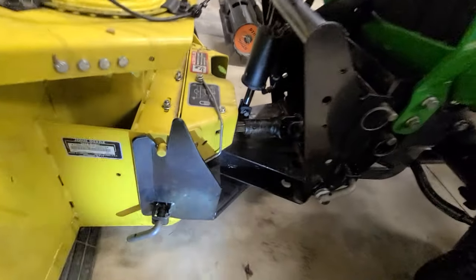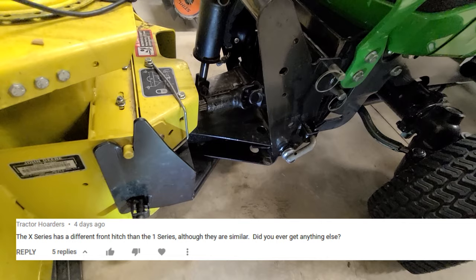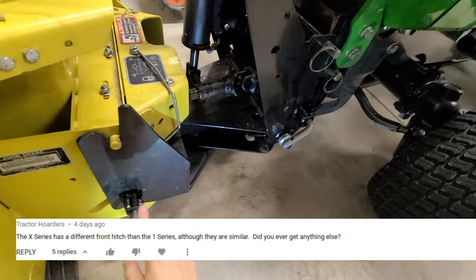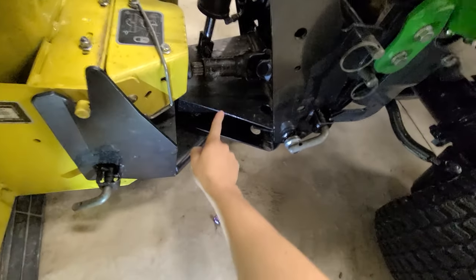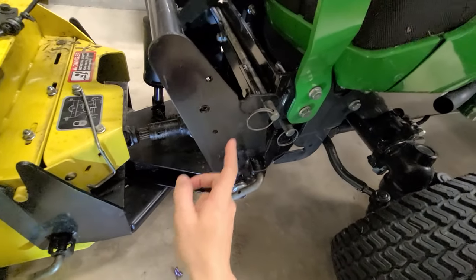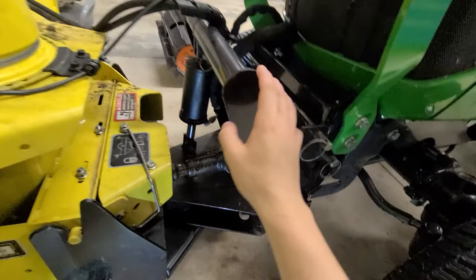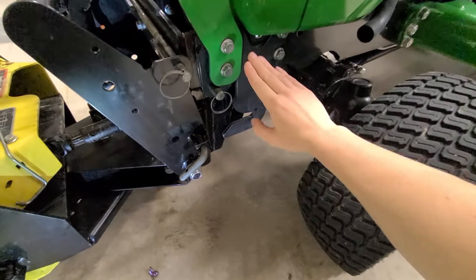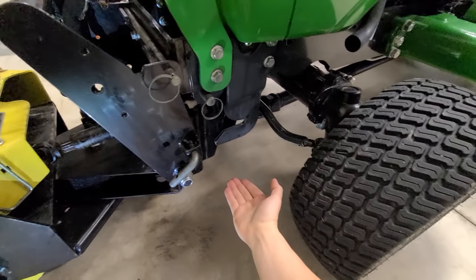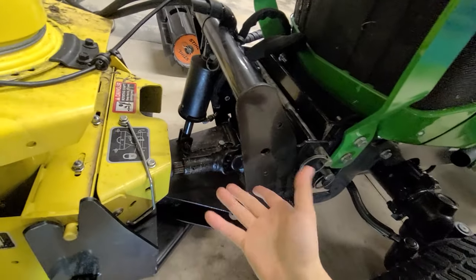We'll address that one right away too while I just kneeled down here. The John Deere 1025R uses a different hitch than the X500, X700. This part here is identical, the exact same part numbers. The only part number that's different is this support here. And my guess is that's just to account for the different heights. A 1025R sits up a lot higher than your X700, your X500. It may be a little bit narrower or wider, but...